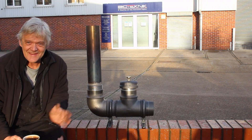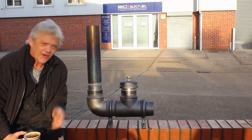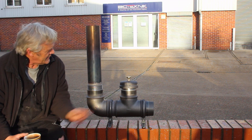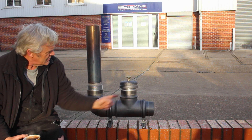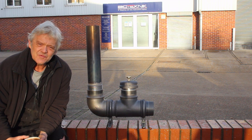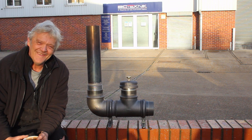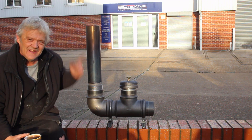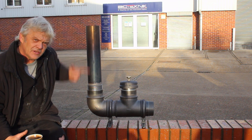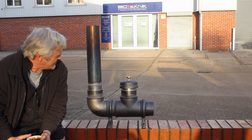That took a minute to get going — you can see it's still drying off a bit. Look at the colour of that. We've got some temperature in there and it's roaring away. You can hear the rocket sound, actually. Pretty cool. Now, according to my reading there is this ratio going around: if the opening size is 100, top to bottom should be 200, from that edge to that edge 300, from that edge to that edge 400. What we found, obviously, is that bit is certainly a bit of BS. If you get smoke coming back out at you, they say you've got it wrong — actually you haven't got enough draw. If you put a longer chimney on it'll pull it through. I'm not sure to what extent that ratio is actually valid, but there you go.